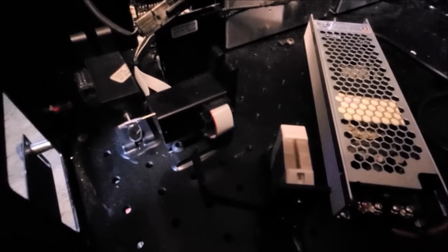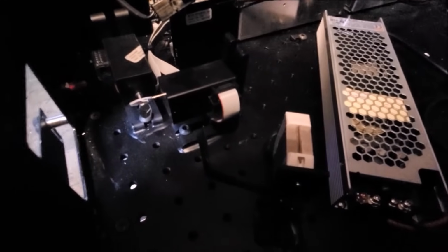Now, currently installed in this laser, there are iMagics, so EMS 4000s, and we're going to pull those out and put in some Dragon Tiger galvos. I think they're Dragon Tiger. But the reason we're going to do that is not because the EMS are bad. They're actually pretty good galvos. The problem is that the mirrors and the handling of those mirrors, the mirrors are too small, and I don't think these will handle bigger mirrors. So that's why we got the other galvos.